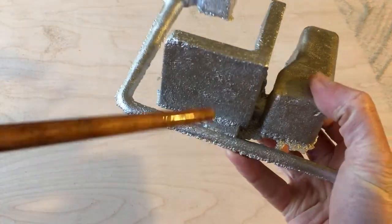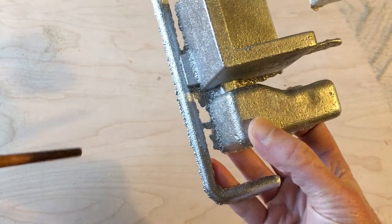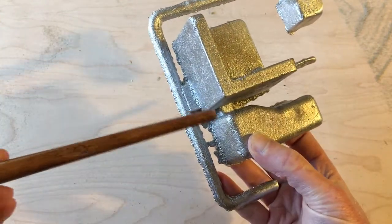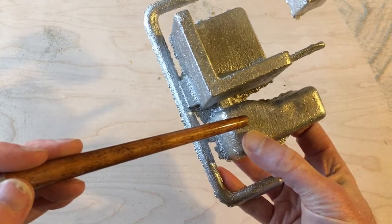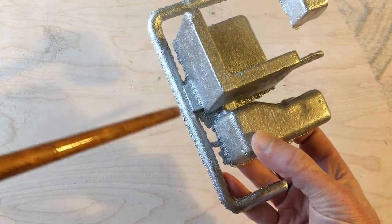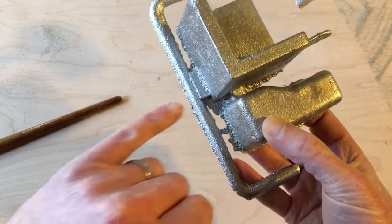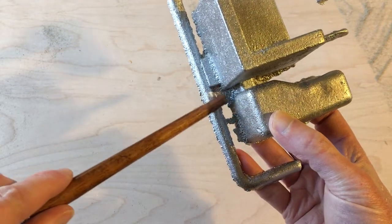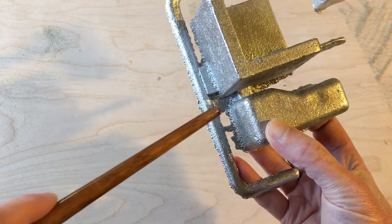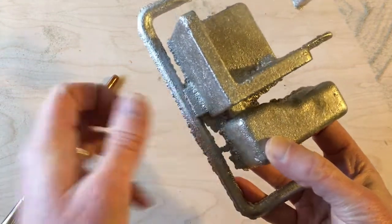This flash is a pretty serious problem, and it's especially probably a problem here. The concern is that this junction between the feeder and the pattern may have frozen early, and may have cut off the feeder from the actual molded part. So there may be shrinkage down in here. We're going to cut this open and find out. Because of the size of this junction between the feeder and the pattern, this has to stay molten, and with all this flashing around it, it may not have.